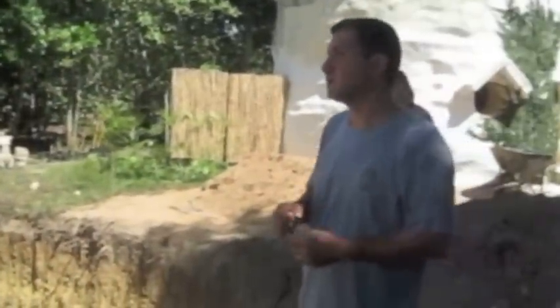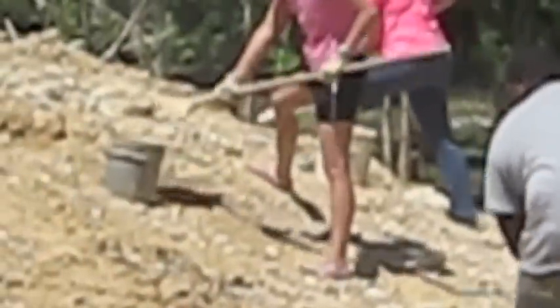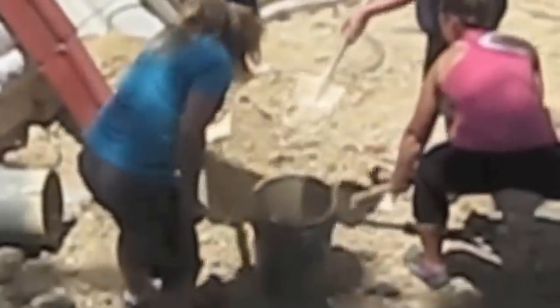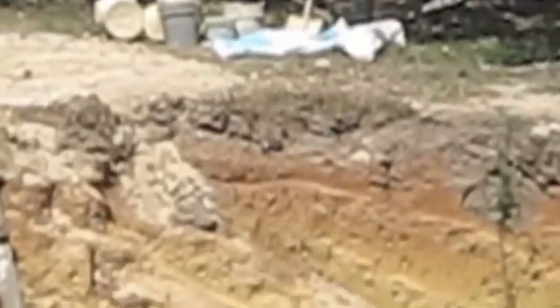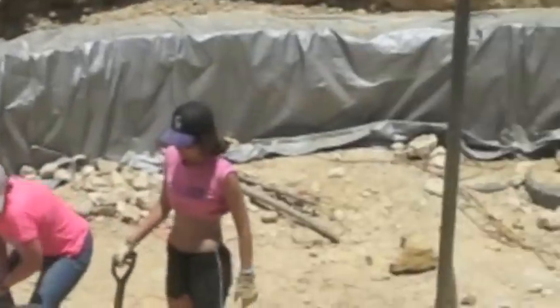Let me tell you how to not throw out your back: just use loose soil and don't dig the shovel in deep — just an inch at a time. Don't try to force the shovel; instead jerk it so that some dirt falls and fills the bucket. We do it bucket by bucket — 20 buckets is the ratio to one bag of lime, giving us 10% stabilization. We stabilize the below-ground work; above ground we just moisturize the soil and put it straight in the bag. We're right now in the hardest part of the construction — it's a lot of work, but it's planned to last a very, very long time.